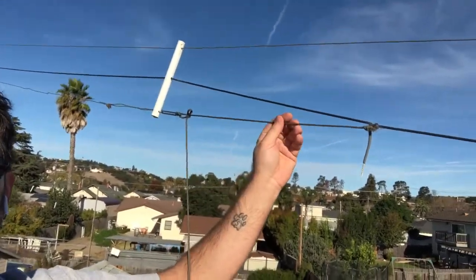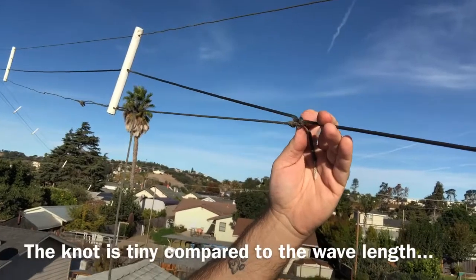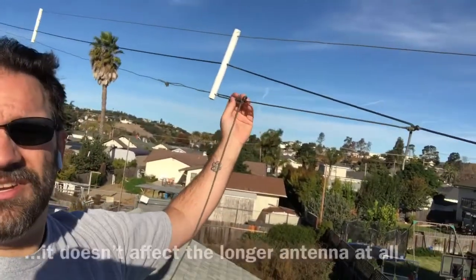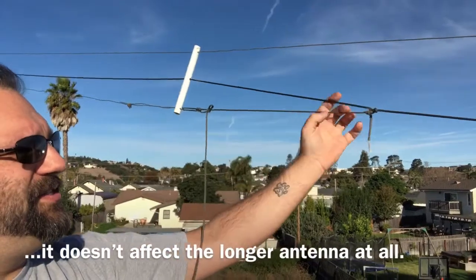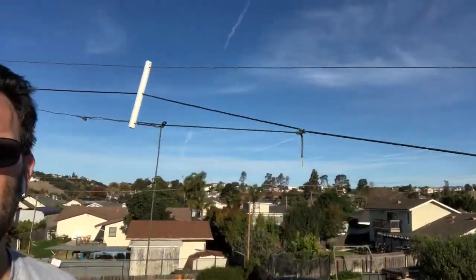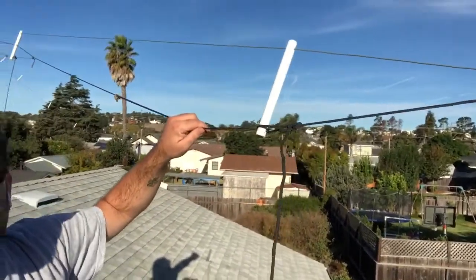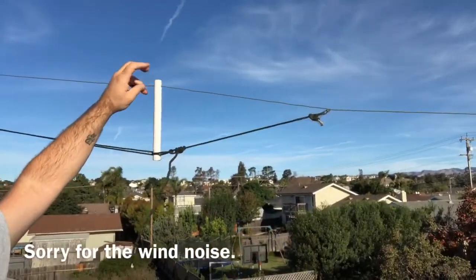Then I've got this rope section that comes along to a little loop I tied in the next longer wire. This right here is just a little knot I put in the wire itself, and I tied the rope off to that. You can see that I can lengthen and shorten this rope to add or remove tension from this wire. This wire here is my 40 meter antenna and it just continues on to the next join. In this way you're able to tighten the longest wire, get it taut, and then go into the next join.